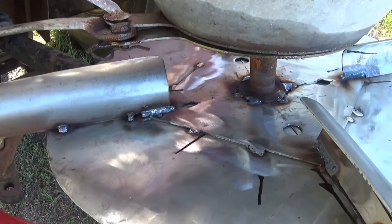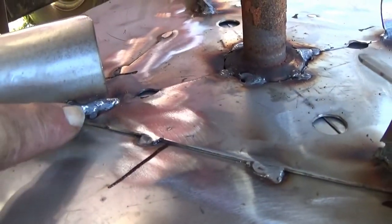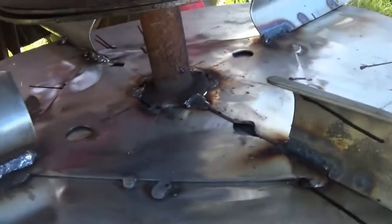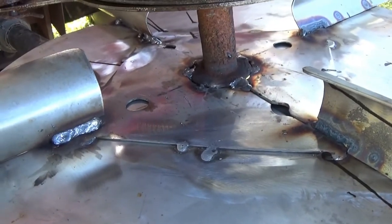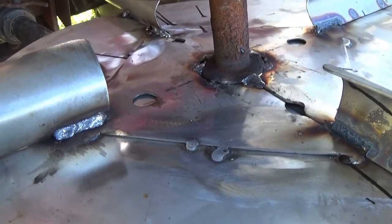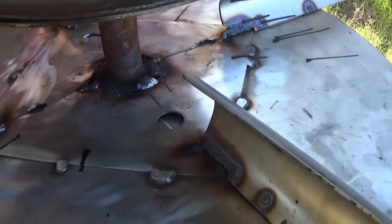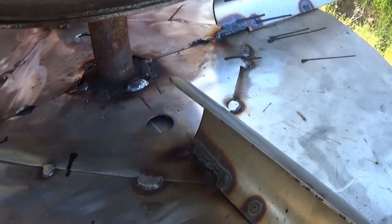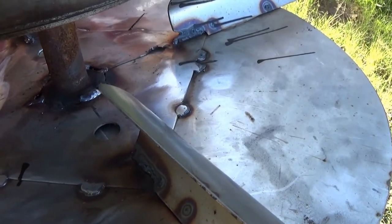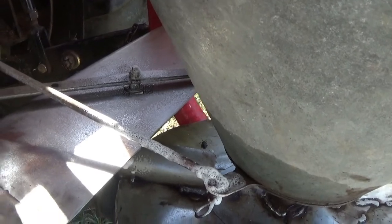In these corners of the flingers — or flights, or whatever the official name is — I've put a good gusset of weld on the backside, which makes it a fair bit stiffer. What I actually did was try to take some of the wobble out of the wheel before I welded it, and I'll probably try to take a bit more wobble out as I do the pocket welds. The distortion from the welding is probably not going to be ideal, but I think it'll be plenty good enough — not a problem at all.